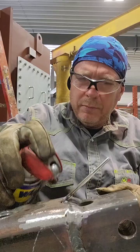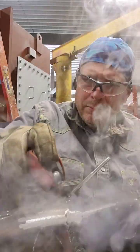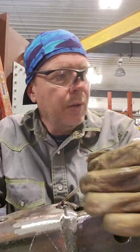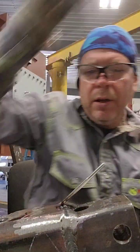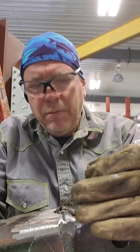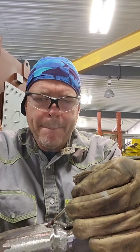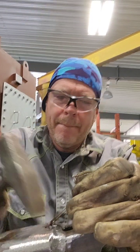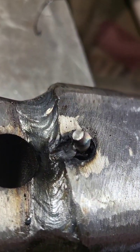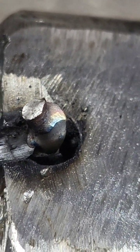I'll try a little WD-40 here. He tried using a MIG gun before it got to me, so there was a chance that he might have welded it to the threads. I'll try to break it loose if it is. It would appear that he caught part of it with weld, so I'm hoping it's just right there on top.